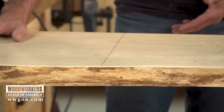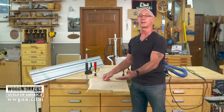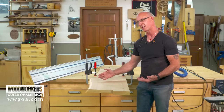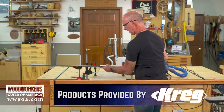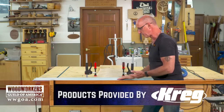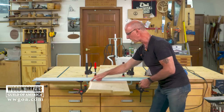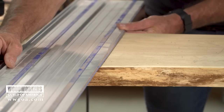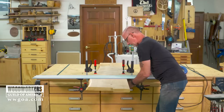Here's where I'm at — my slab is secured to the table, a beautiful piece of white oak. My leg length is currently too long; I like to not cut it to finished length until after this part is done, so I'm oversized by about an inch right now. My track is ready, and a track saw like the Kreg unit is a really good way to do this because the track guarantees you'll travel in a perfectly straight line. We've got this great line-of-cut indicator, so I put the edge of that rubber strip right on my layout line and clamp the track in place.